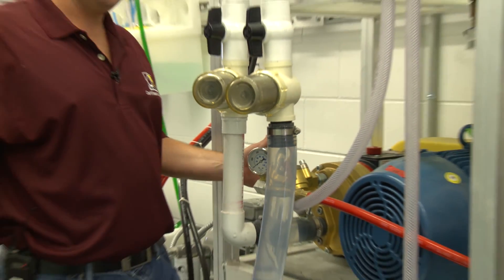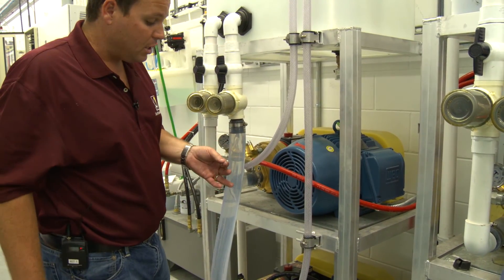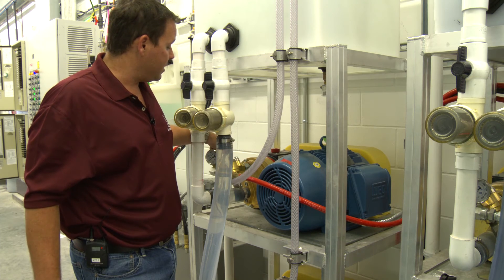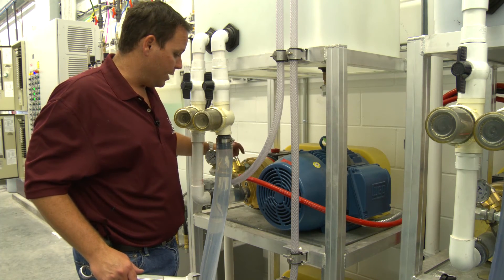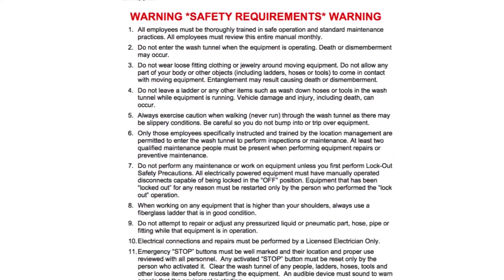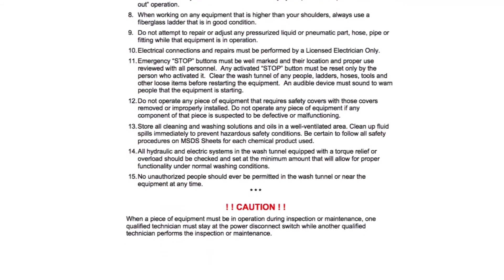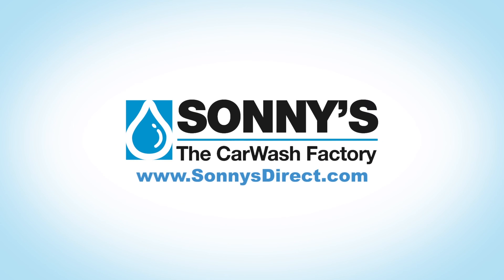Another common thing with these regulators is they will go bad. They have a little hole on the side — there's an O-ring and seal down in there. Over time it'll go bad and they'll start shooting water out of there. It's a very easy rebuild kit, not a lot to it — very easy for somebody mechanically inclined to rebuild. We do sell those rebuild kits, and it's a lot cheaper than replacing the entire unit. And that is our service on our H25. Thank you for watching this maintenance overview video. Please visit SonnysDirect.com and review the complete owner's manual before attempting any installation, maintenance, or repair of this component. There you'll learn necessary procedures, settings, and other considerations required for the safe operation of your car wash equipment.